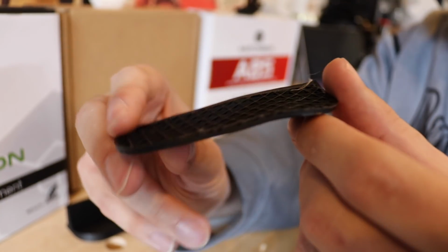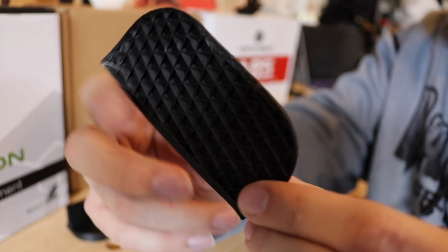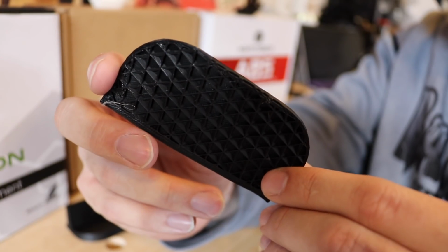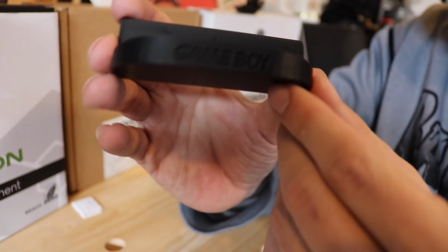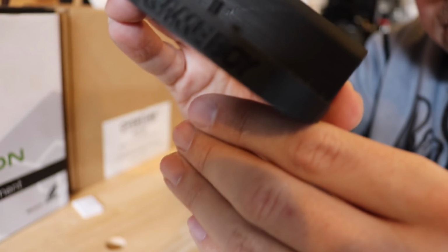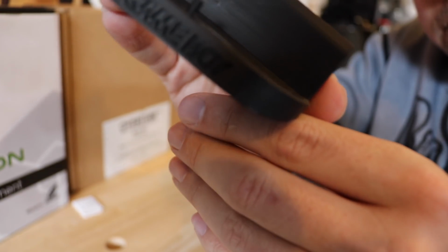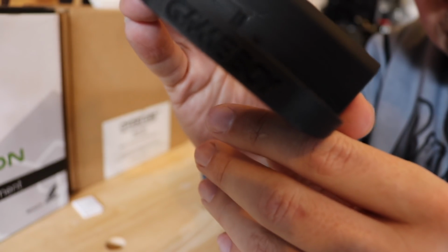All the parts that I've been printing, I've been battling the elements. I had set the bed to 75 degrees. I lowered the bed temperature down to 55 now, since I'm not dealing with any atmospheric issues, and now the part came out like this. This is a higher speed than I like to print, and I'm definitely having some issues. My nozzle crashed into the bed, so I think that's what this is. I need to replace the nozzle. But otherwise, there is a very faint corner where it looks like there's a slight warp for this PLA.